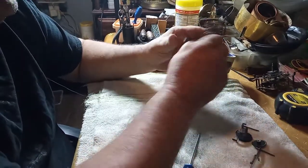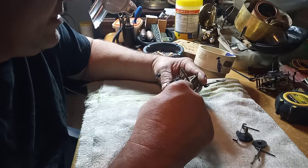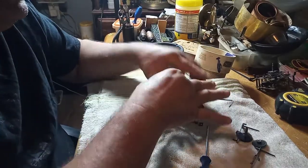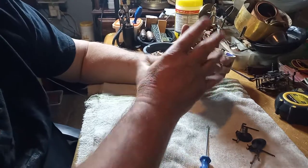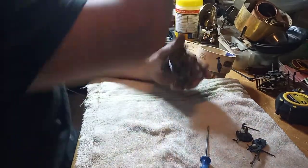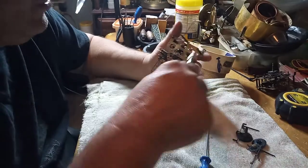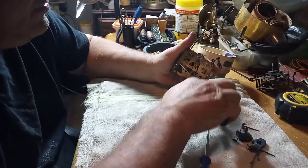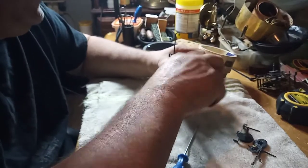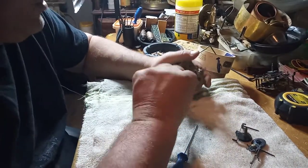Now I can take the rack stop lever off and the lift lock lever off. Next I want to take the eight-point star wheel off — this one has a screw that allows you to take it off rather than being pressed on, which makes it easy to take the movement apart and put it back together. Next step is to take these four nuts off. I like using a socket for this so I don't damage the nuts — putting pliers on them can damage them so they won't go on or off easily.